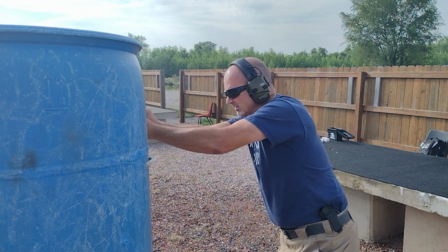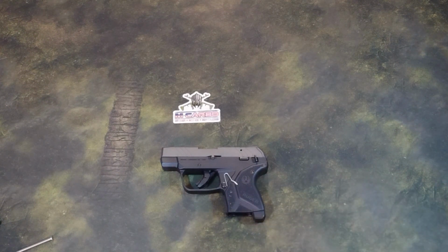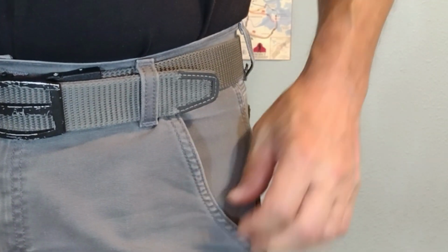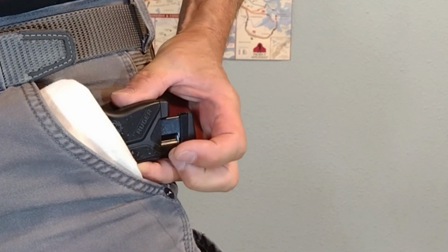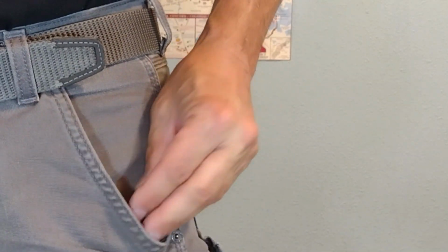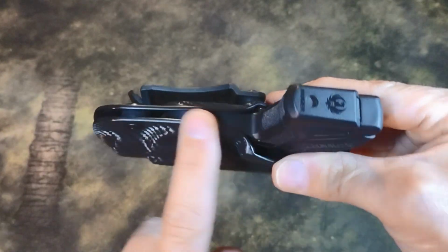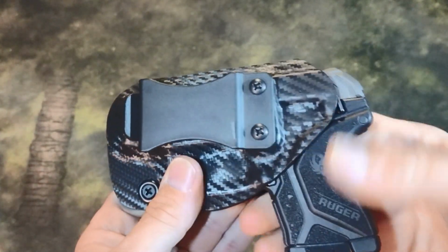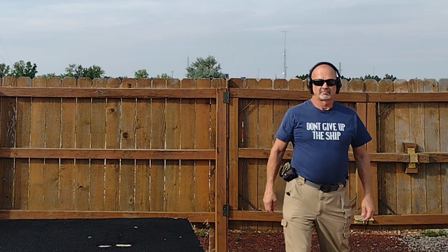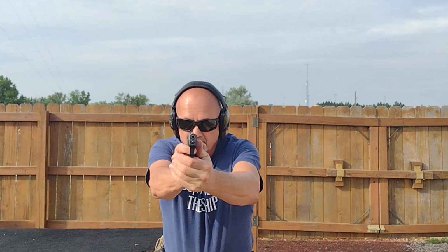What do you get for all of this effort? M-Carbo's stiffer mag button spring cuts accidental mag disengagements by about 70%. It doesn't eliminate them, at least for me, when using the soft pocket holster included with the pistol. Get a pocket Kydex holster that provides good coverage of the trigger and protects the mag button. I haven't found one yet, so I would probably make my own. But between the stiffer spring and a Kydex holster, this problem should be pretty much eliminated.